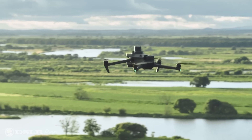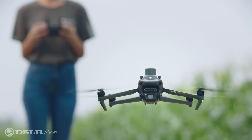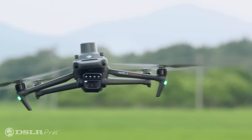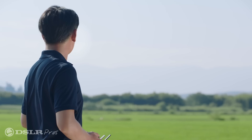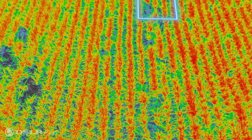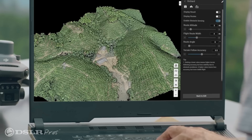With the release of the new Mavic 3M, DJI's taken everything that we liked about the P4 Multispectral, improved upon it, and put it into an even smaller and more efficient form factor. Based on end-user feedback, DJI's removed the blue spectral band in favor of a much larger 20 megapixel RGB sensor — the same sensor found in the new Mavic 3 Enterprise — which is intended for surveying and mapping. In addition, they increased the resolution of the individual spectral bands from 2 to 5 megapixels. This allows you to collect crop health data at twice the detail or obtain that same data twice as fast. You'll no longer need to choose between a drone to collect spectral data for plant health or one to collect spatial data for mapping purposes — the Mavic 3M is capable of both.